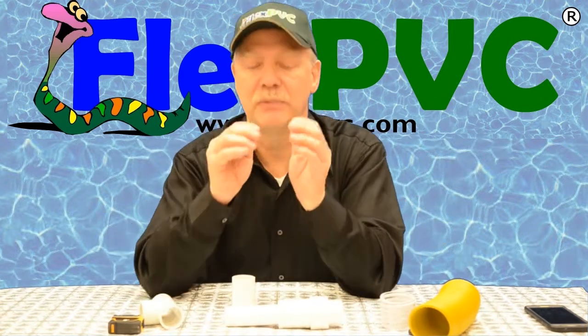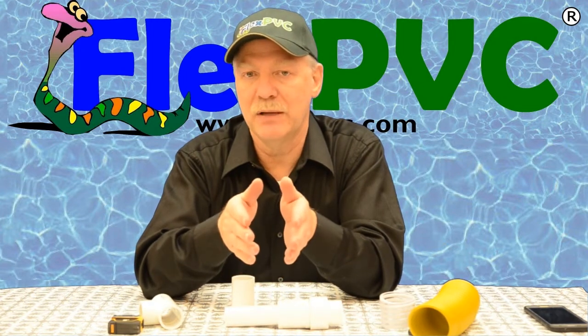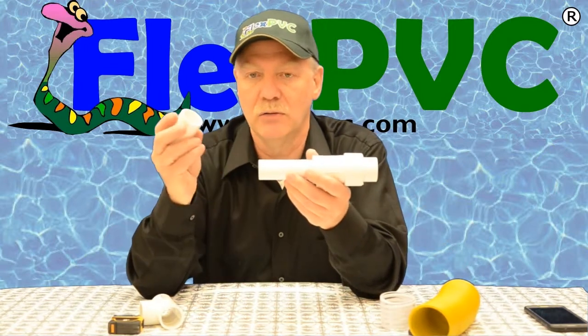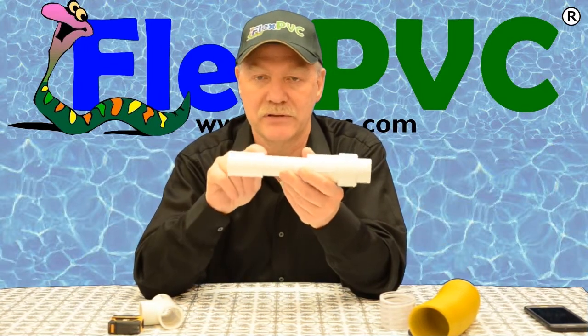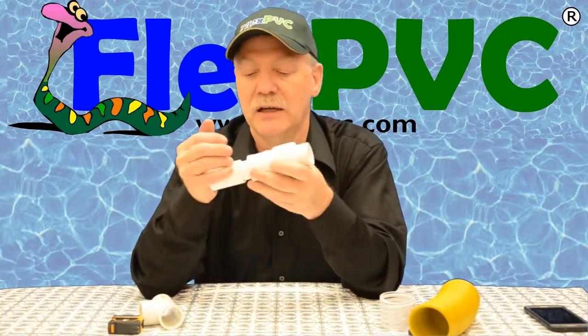So let's assume you've got a localized damaged pipe and you can cut that damaged section out. The first thing you're going to do is take this and glue on a coupling — I'm just pushing it on here because they're hard to get off, but make believe this is glued on all the way. Then you're going to collapse it. Once you collapse it, this is your cut length.